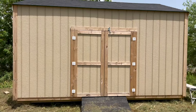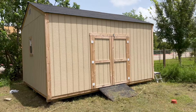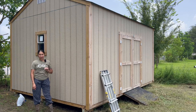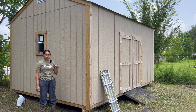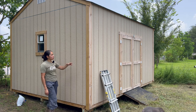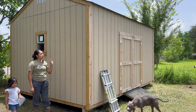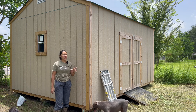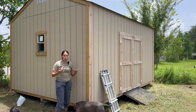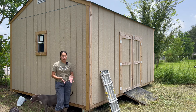This is what it looks like for now. The first thing I have to do is start caulking everything — all of the seams, all of the holes from the nails and stuff — and then I can start priming. But until I cover all of those holes, I'm not going to prime. I want this to look good and to obviously last a long time, so I'm trying to do as good of a painting job as I can.